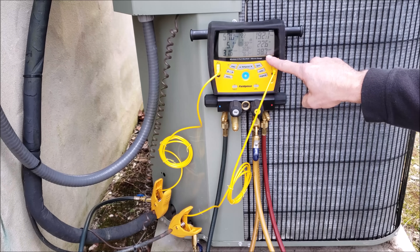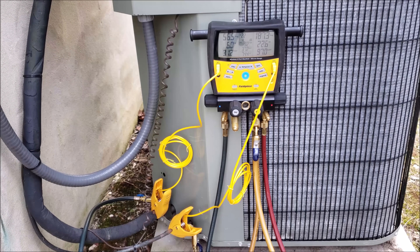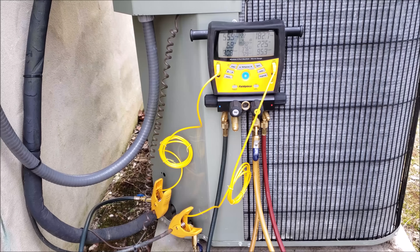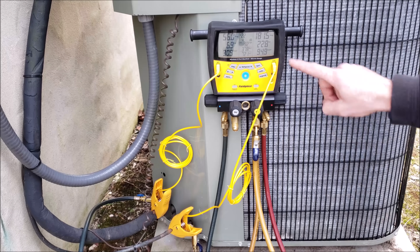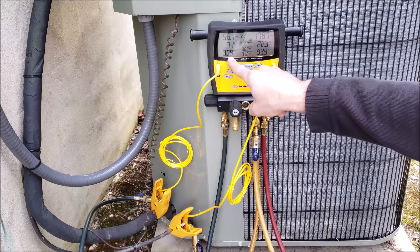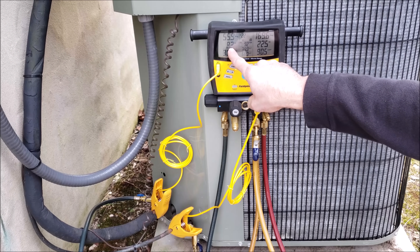The saturated temperature is falling, and the vapor sat temp is now getting below 32 degrees, so the evaporator coil is starting to freeze. We have to check this very quickly. The subcooling is actually very high — the rating plate shows a target subcooling of 12 degrees, but we're reading 23 degrees of subcooling, which tells us the system is overcharged. Once again, we don't have much heat inside the building to absorb. If the indoor temperature were 74 degrees we'd have no problem keeping the high side up. The superheat is rising into a normal range.